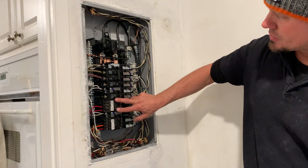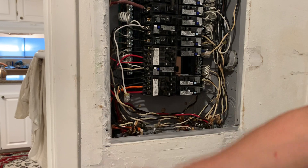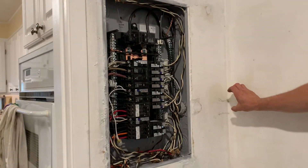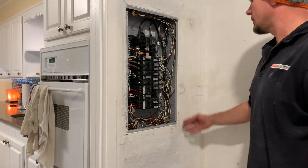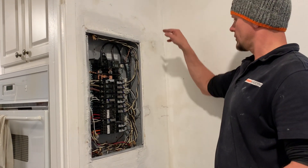I don't want to turn that on because I still have to make up that wire down there. I threw down a 14-3 when the wall was open — we had to cut it open pretty large to get the conduit through — and then mudded it the best we could because there was already some drywall cracking, especially with the plumbing that was going through.